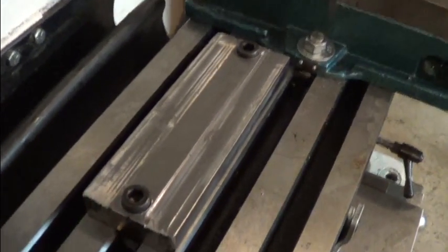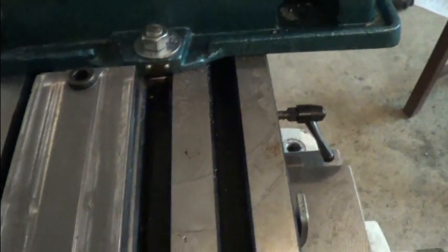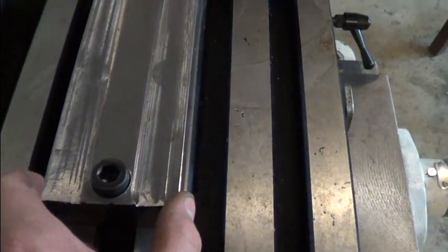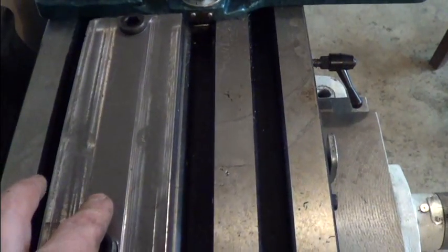I'm going to cut out those blade blanks so I can figure out where I want my holes for the 10-32 to hold it down through the pivot hole, and where I want my clamps to be set. This is what I cut out the last couple days, off and on. You can see this is angled in 3.5 degrees, which is what AutoCAD said the blade bevel should be. This is 2 inches, 780 thou wide. These are 935 thou, so that gives me roughly 800 thou for my toe clamps.